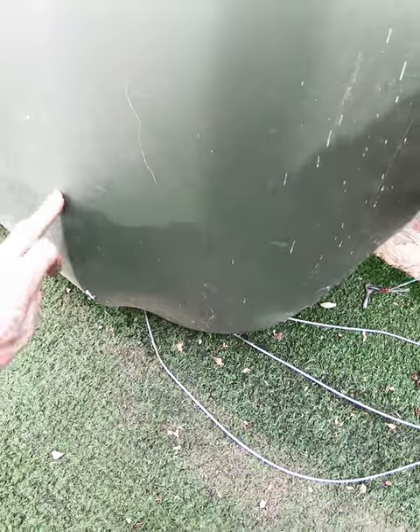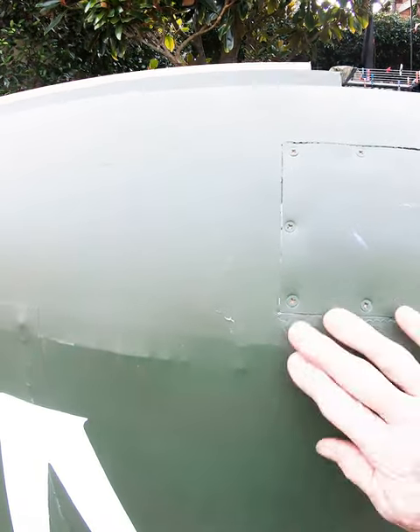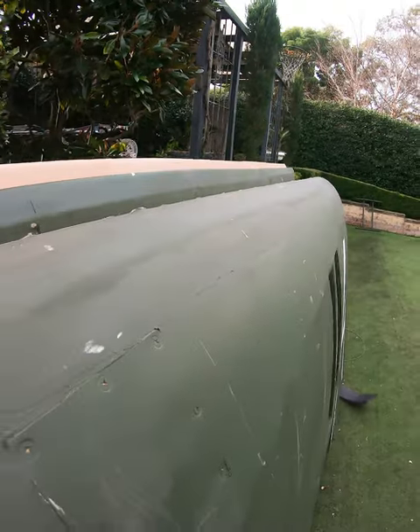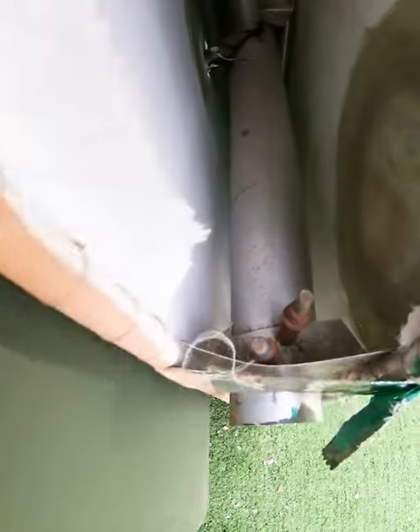The finish on things like the bottom where the wing section cambers is just a sharp edge with a hollow out to the end — it hasn't been finished off, and there's no support in that whole section. Nothing seems to be straight. He's got little inspection ports but they're not square, and there are funny little add-ons. You can see where he's gone along with the pinking shears, but if I follow my hand along it's up and down — it should be straight on the bottom. So there's no debate about stripping it.